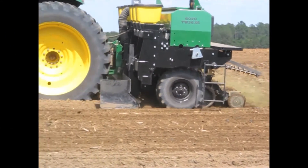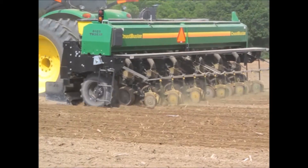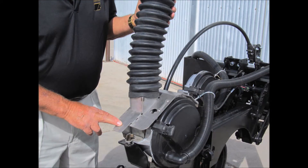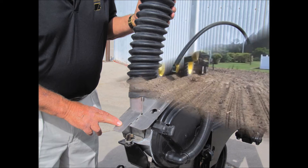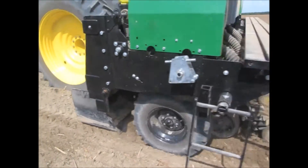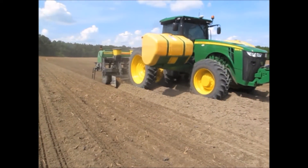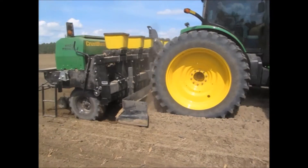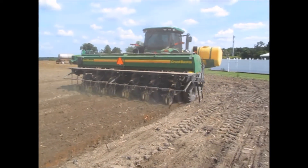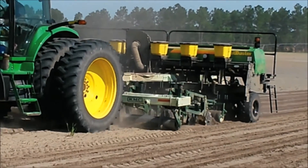This large capacity box is carried on the frame supported by the land wheels, and the seed is delivered to the row units via large convoluted hoses. Therefore, the opener weight is consistent and not varying between a full box and an empty box. The variation in a typical box-style planter is approximately 150 pounds between a full and empty box, causing the opener to run deeper or shallower depending on fill. Expensive adjustable airbags are being put on competitive units to deal with varying opener weight, with the operator continuing to guess the proper pressure throughout the emptying of the box. Crust Buster's down pressure is consistent and uniform regardless of the fill of the box.